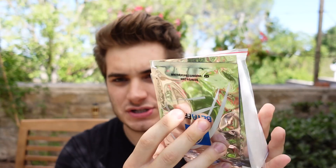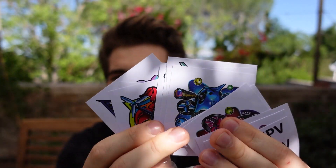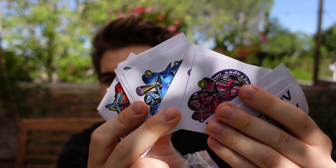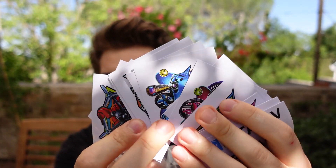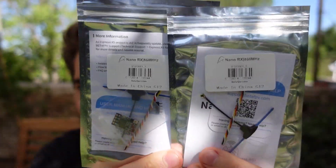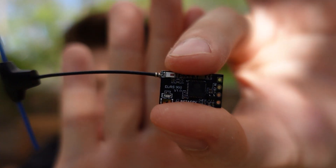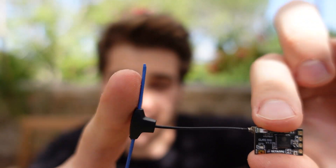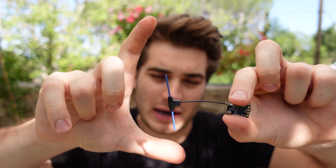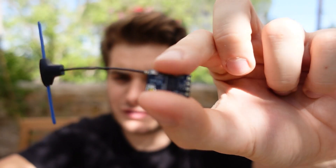Then we have the real content of the package. There are four bags here. They sent me the biggest amount of stickers I've ever seen — it's like playing cards, crazy. And then we have two receivers for their ExpressLRS 868 megahertz system. The receiver itself is the same size as the R9 and Crossfire, but the antenna is a quarter wavelength antenna, so it won't perform as well as a half wavelength antenna — but it's incredibly small and blue. ExpressLRS theoretically has crazy range, so this should not be an issue.